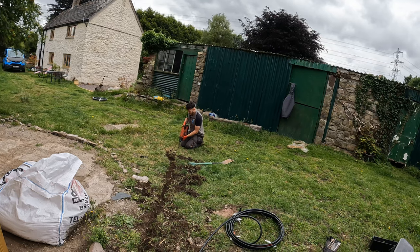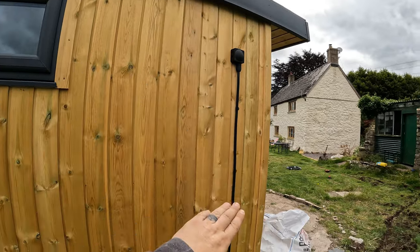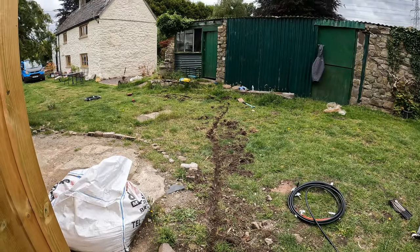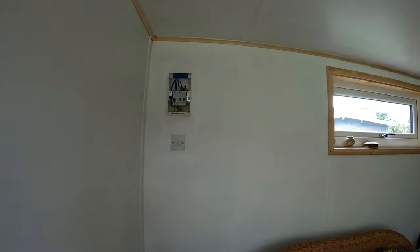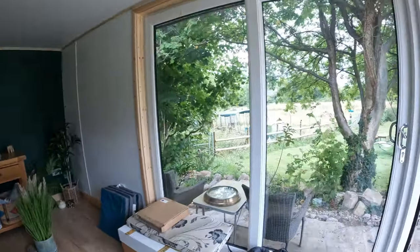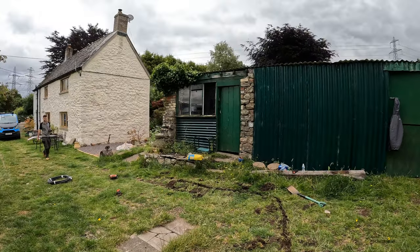So this box is now connected and cleated to there. I've got to dig this bit out and then we go down this trench — Layton has done a lovely straight trench, well done. Inside, I've just connected the consumer unit — as I said it's already pre-wired, so we've just taken our supply in: line, neutral, CPC. I'll leave the lid off until we've tested.